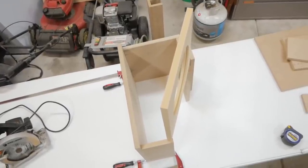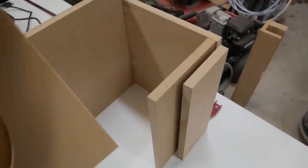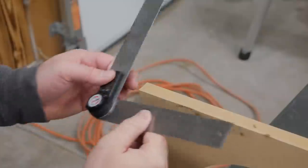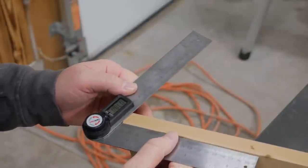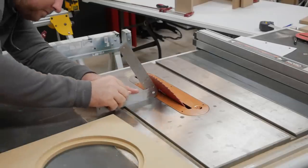After making most of the cuts I mocked up the boxes to get the angles I needed to cut for attaching the front baffle. To do this I set the baffle on the front and bottom pieces at the correct angle and made marks where I needed to cut. To make sure I had the correct angle on my table saw I used an electronic angle finder to find the angles and set the blade on my saw.